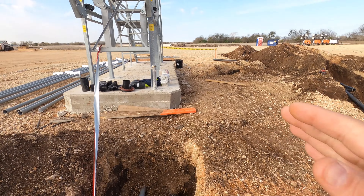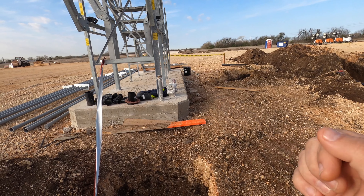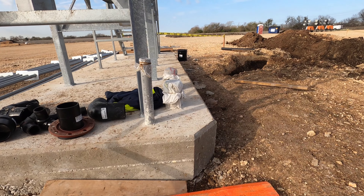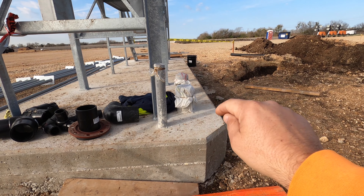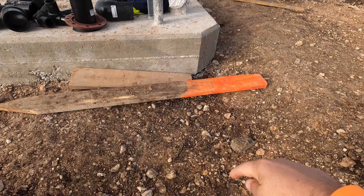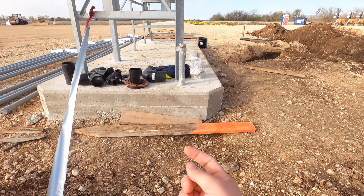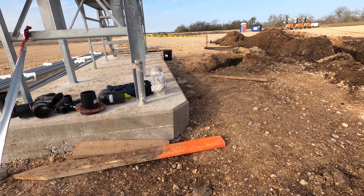With the trucks driving here all the time, a lot of people like to put their pipes on the outside and they're constantly getting hit — knocking the pipes and stuff off. So what we like to do is come in right here. You can see where these little plastic bags are — that's our piping. We like to go through the concrete so it's inside there, come out here where it's plugged in. That's where the fresh water will come in. Same thing with electrical — it's going to come up that way.